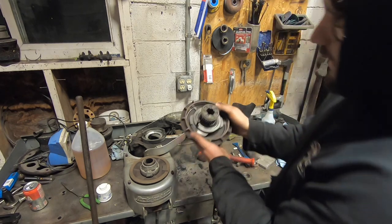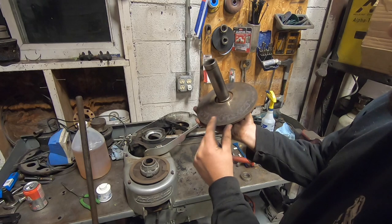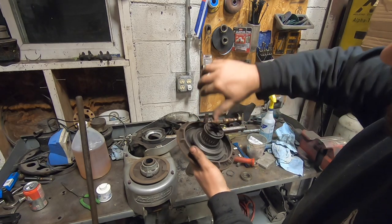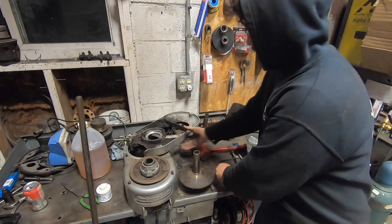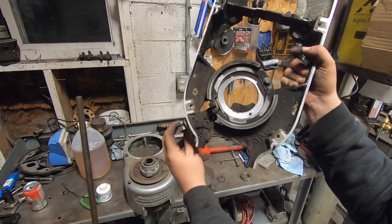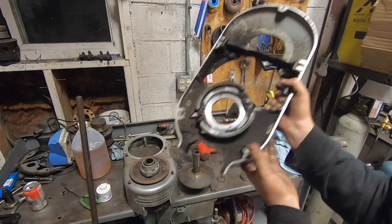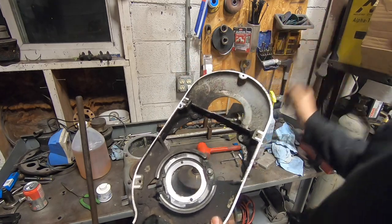And then there's the bearing up behind this plate. This is your brake drum, which is the bottom side of your front pulley. It's got a little bit of pitting as well. So I'd like to get this assembly apart and replace that bearing. Over here are your brake shoes — literally works just like a car or tractor to slow this thing down. One of the springs is broken and just dangling around in there, which was making noise. So I need a new brake spring.